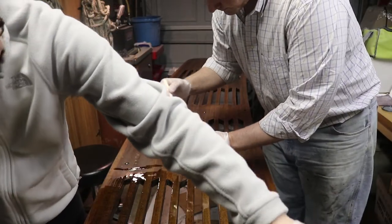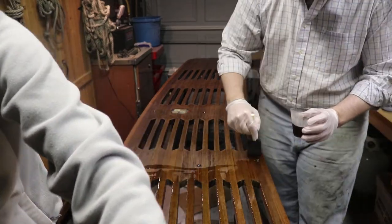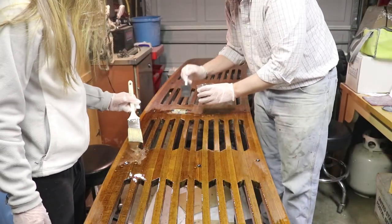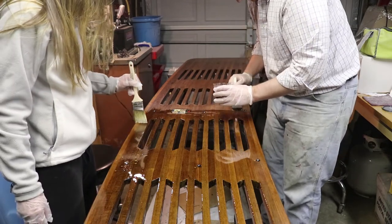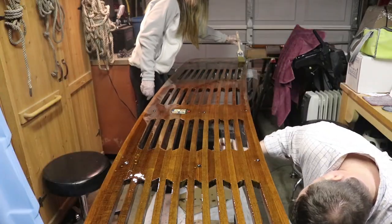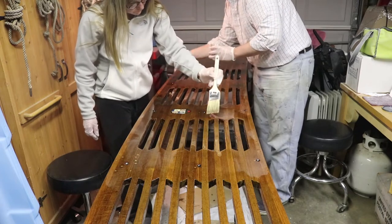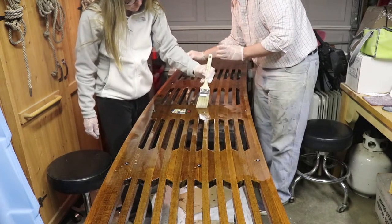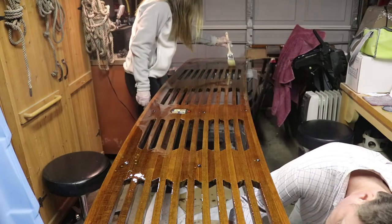We're varnishing one last time to get this platform a nice glossy look. By now, we should be free of any nasty bumps. Because we've sanded this surface so many times, it is super smooth. This is our last coat, so you want to try and get every inch covered — we're not putting any sandpaper on it after this. So we really want to make sure that all the air bubbles get tipped off this time. Work the varnish around as much as you can — it's a lot like pushing honey around at this point, but make sure that you get this coat as smooth as possible.